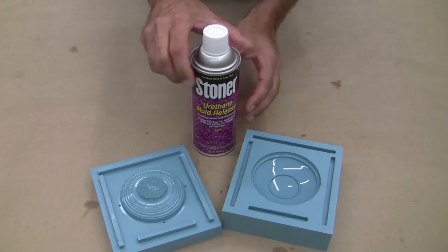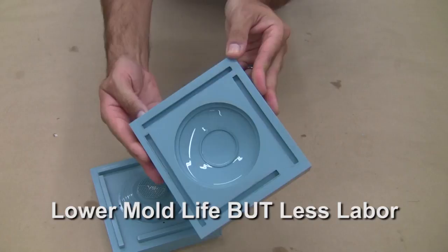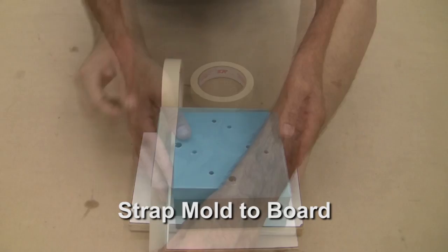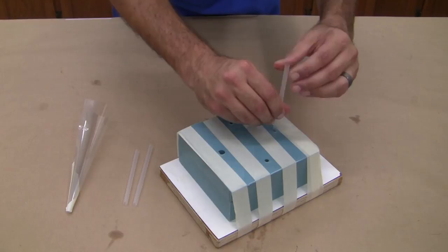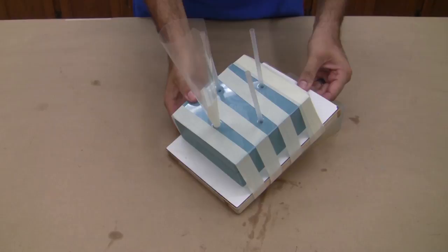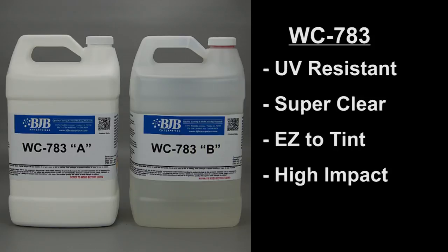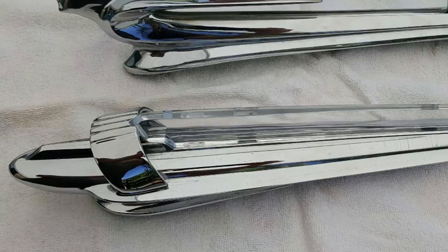Time to cast the lens. Normally at this stage we would spray an appropriate mold release onto the mold, but in this rare case we will opt not to spray mold release so our shiny surface is not compromised — you can expect a lowered mold life by doing this, but you save a lot of labor time by not needing to hand polish the cast lens piece later. We will strap the silicone mold to a rigid board to prevent any flex and to allow a way to angle the mold during casting. Don't over-tighten the tape or you can distort the mold. The material we will use is BJB's WC783 Water Clear Polyurethane, which has proven itself for aftermarket automotive lenses due to its unique UV inhibitor additives and natural color stability over other casting resins.